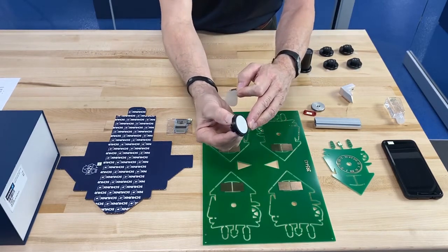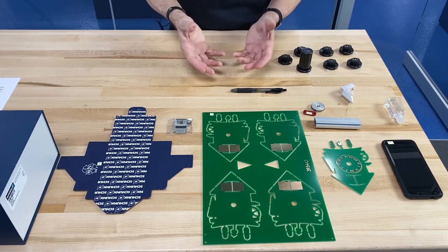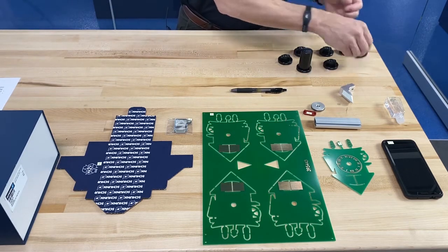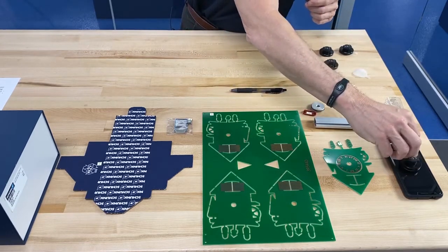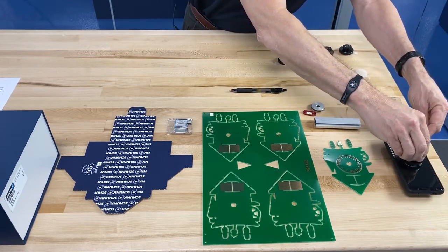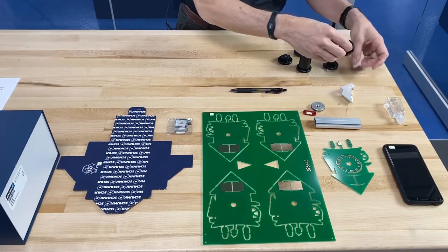This almost looks reflective, but the hairs are very tiny and work like the big ones, just in a smaller fashion. The advantage of Adheso is that if you grip parts with it, you leave no residue. For instance, if we pick up glass or silicon wafers, we would use the long fingers. You can see we can very effectively pick up smooth surfaces like this. When we release, you have to twist to get the hairs to bend and release. There's no residue left over from the Adheso — this is very good for the silicon industry where you're handling wafers.